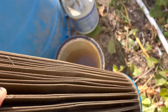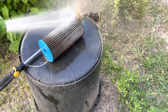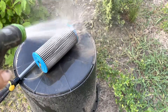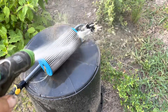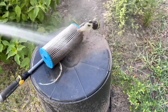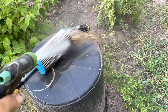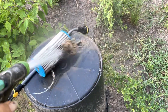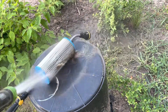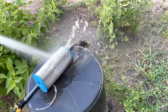I'll take this off and have a look at this dirty filter. Yeah, that's got a lot of iron and stuff on it, so I want to see if I can rinse it off. I'm glad that's coming off. In the future, if it gets to where it's really stuck with iron and clay, I'll have to soak it in oxalic acid for a little bit. I bought an extra filter so I can put the other one in while this one soaks — I read that works well.